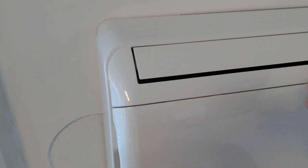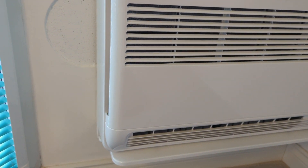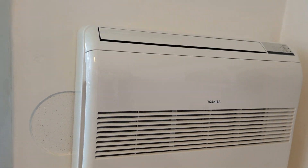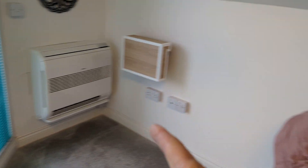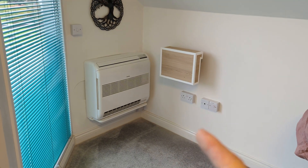This flap also opens up and you can direct it upward if it's a very hot summer's day and you want cooling. You can choose whether air comes out the top, the bottom, or both. It draws in through here through a filter. What that does is make sure all the warm air is coming out and going along the floor, so you get heat from the floor upwards. That means you get no draft and no stratification, and the device works to the set temperature wherever the remote is.